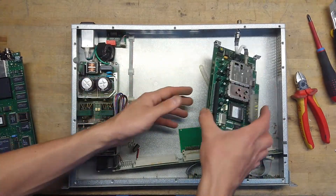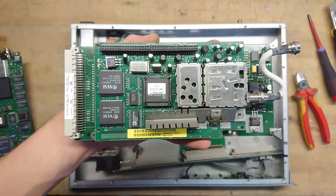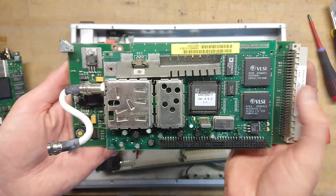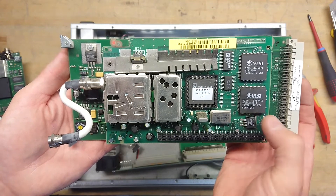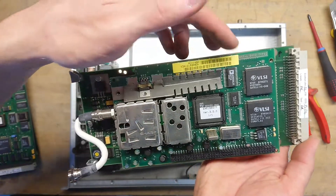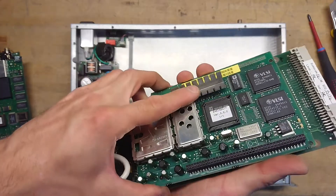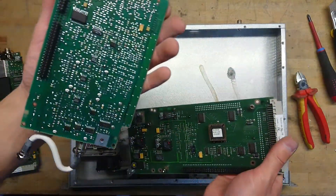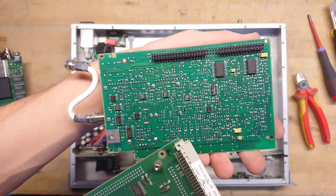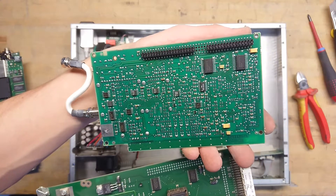Over on the input board we have the receiving filter. There's a 5V regulator that seems to run quite hot. There's a Philips chip sitting here along with VLSI satellite DVB chips and a Satellite FEC Comatlas chip. Quite some specific ICs here, along with an Analog Devices 9066 running at 61 MHz — interesting to see what that does. It's quite packed but also a straightforward design, with nice spacing for decoupling capacitors in the right places.